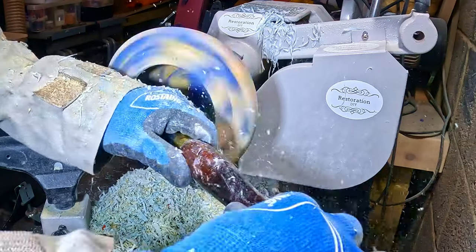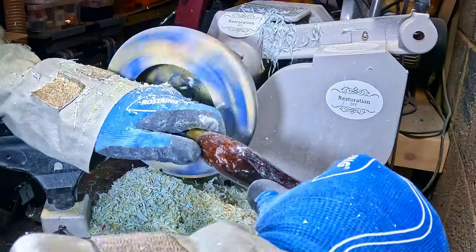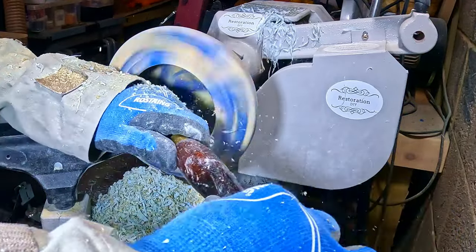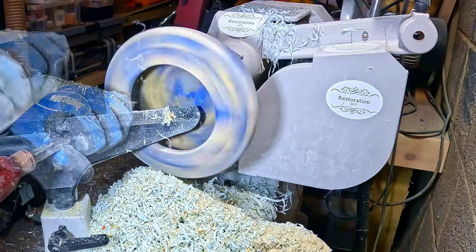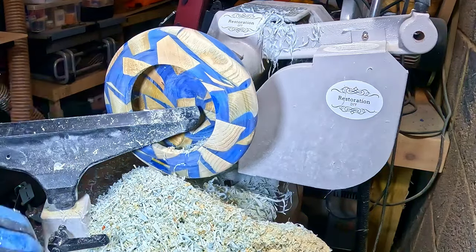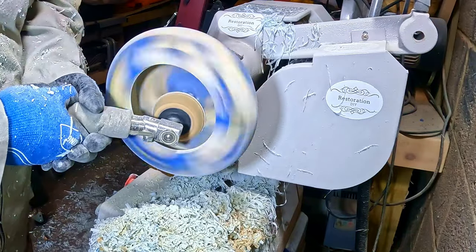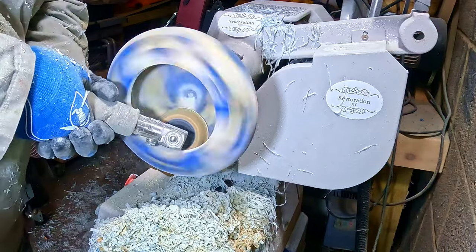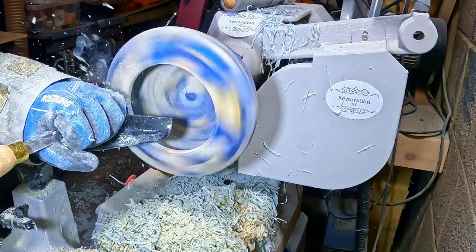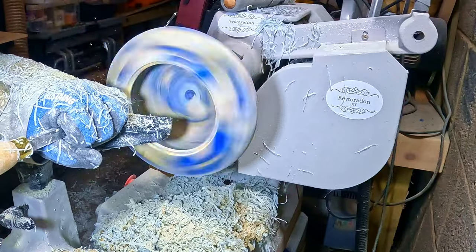After the final check and a few more passes with the scraper and the mid-sized carbide cutter, the inside was done with not one catch or mishap. I sanded both inside and out to check for tool marks, and apart from the finishing I considered leaving it at that — but it needed something else: a lid. So I used the parting tool to cut a recess to locate it, then I finished sanding from 80 to 3000 grit.